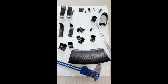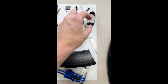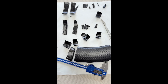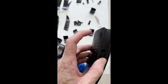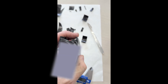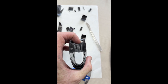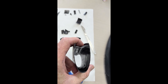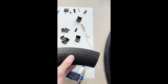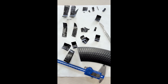We've just done a burn test of a Scope Artec 6 rim. We cut a section off the end of the rim and pulled apart all the layup. The key thing we were trying to find out was whether the outer layer went over into the hook valley section of the rim. It doesn't - it stops at the top and there's no overlap of fibre into the valley. That's pretty normal with a lot of rims, but this is obviously a different factory than before because it used to do that. I'm not sure exactly which factory it is now, but it's definitely a different layup schedule than previously.